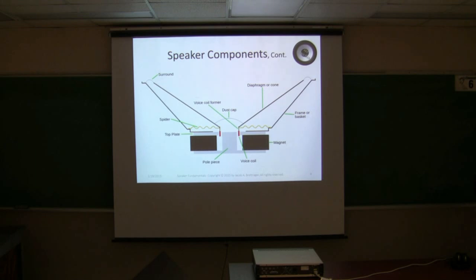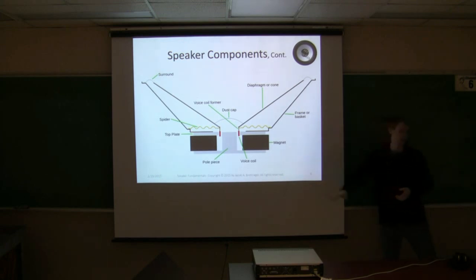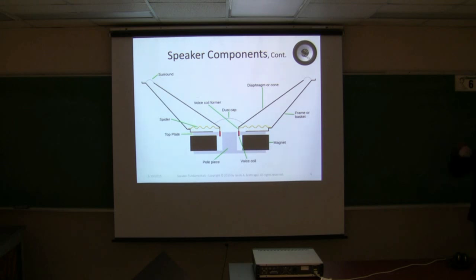In essence, what you're doing is pushing electric current through that voice coil, which creates a field around the coil. Most of you probably have taken EE 305, so you know that current through a wire gives you an electromotive force or a field around it. When you have that external magnet — the big magnet on the exterior — when those two fields interact, that's when you get the electromotive force, that's when you get the actual movement. The cone, which is connected to the voice coil, moves when the voice coil moves — that's what you actually create pressure waves with, that's how you get the sound.